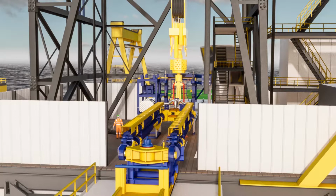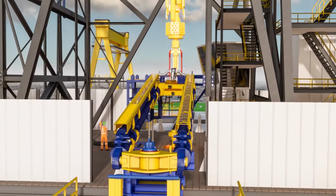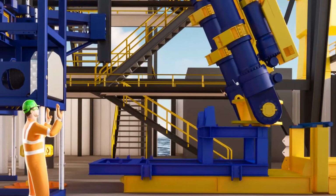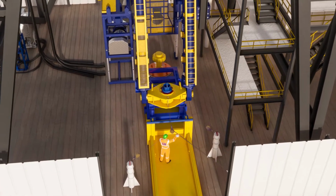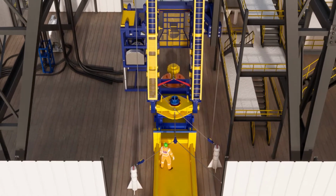Next, the top drive is hoisted while the riser skate is simultaneously traversed forward, upending the CTLF. Once the riser skate reaches its maximum forward position, rigging from the drill floor tuggers is then reconfigured in the pre-engineered arrangement to provide lateral stability while lifting the CTLF vertical into the derrick.